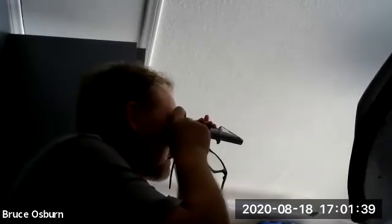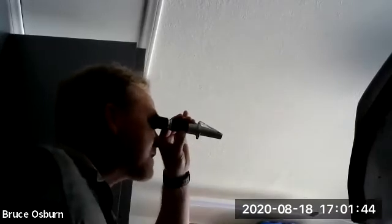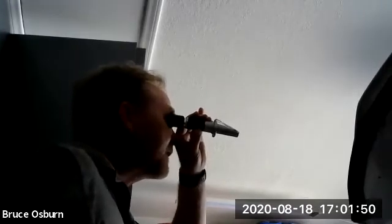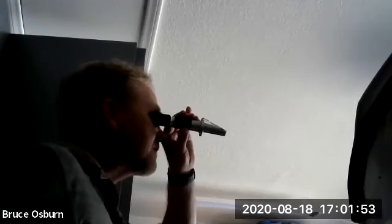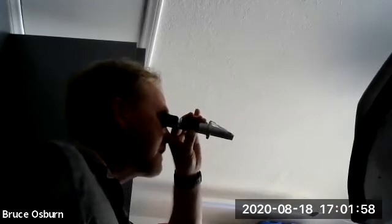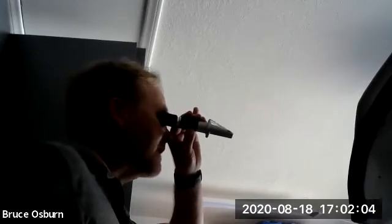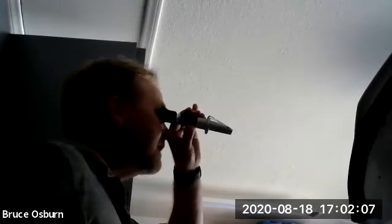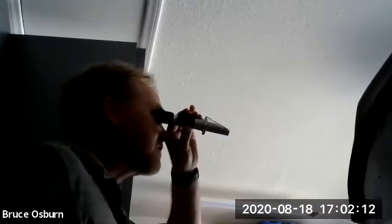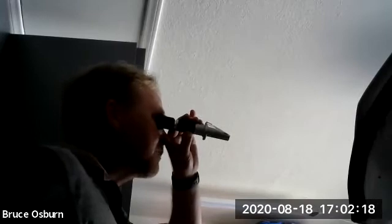You can focus the tool by turning this. And one reads about minus 45 degrees. Actually, they both read about minus 45 degrees. They're different in the higher temperatures, so around 0 and 10 and 20 degrees. The differences between propylene and ethylene are quite different. But down in these lower temperatures, minus 40, minus 50, the scales are just about equal. So in this one, minus 45 degrees is what my freezing protection is.